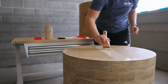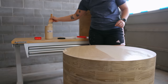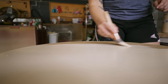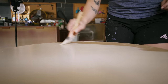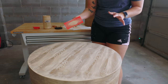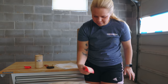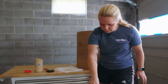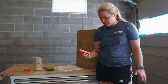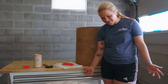Next I am going on the top, just following the wood lines I made previously with the primer and the gel stain. I'm going to try the larger wood graining tool to test that out on the tops. The flat area is definitely a lot easier to use the wood graining tool on, and the big one also made it go by really quickly — so the top's done. That's how quick it is if you're on a flat surface.